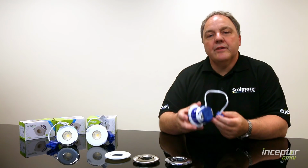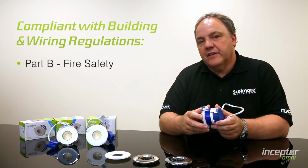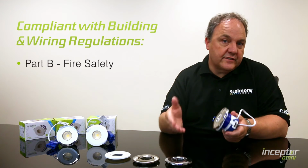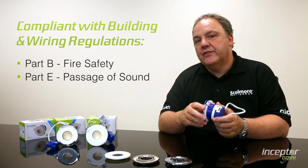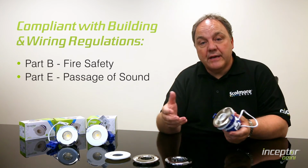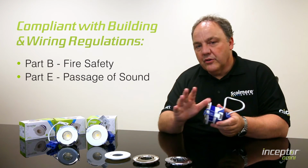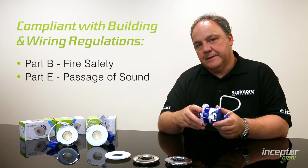The Inceptor Omni complies with all building and wiring regulations. Part B is concerned with fire, and so the intumescent strip gives this a fire rating of 30, 60 or 90 minutes, depending on construction. Part E is concerned with resistance to sound and the passage of air, and so installing Inceptor Omnis in a building will not impact the sound effectiveness of the building.